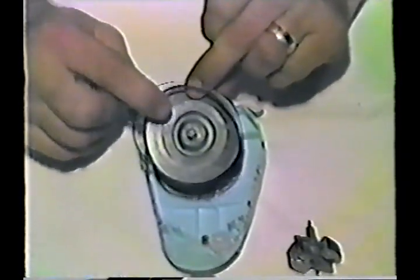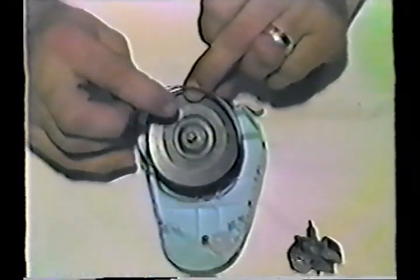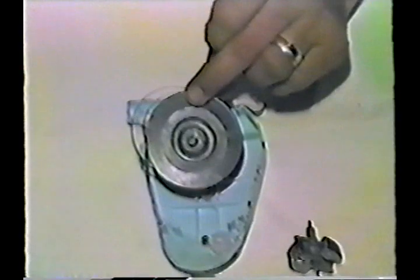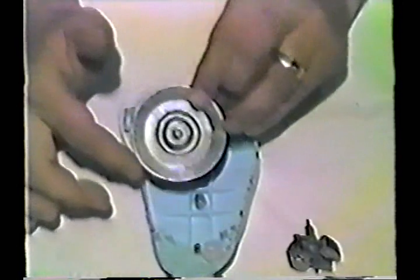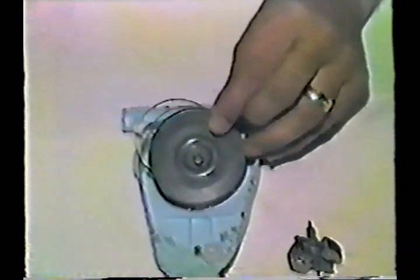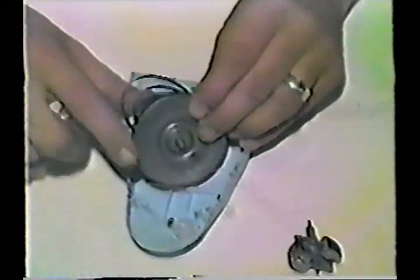The new O-rings will fit fairly tight on there, and then you have to take the flat nose tweezers and pull it out to get it back on. Okay, we need to clean this surface off because it looks like it's got grease all over it in this area. We'll need some Kleenexes to get most of the grease off of there now.